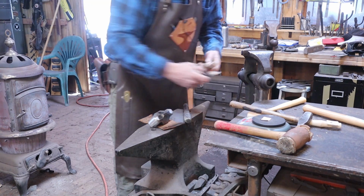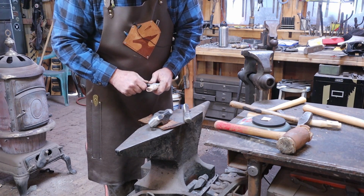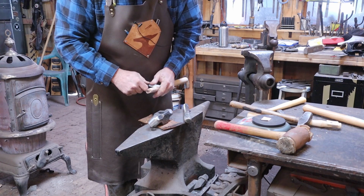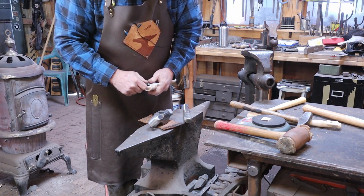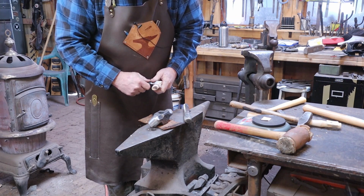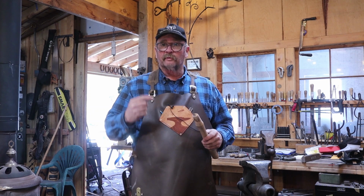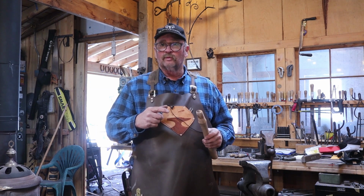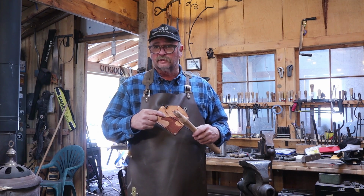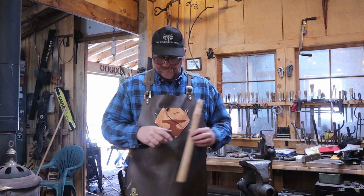I think I'm going to go finish this up inside where I've got a spoke shave and a knife that's actually meant for whittling type work instead of using the pocket knife I use for opening the mail. Hickory is tough stuff. Let's head into the basement workshop where we can finish this handle. That way we can cut a wood wedge that fits just exactly right instead of using the slightly undersized one that was included with the handle. And I have some tubular metal wedges, which I like better than the flat ones.